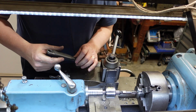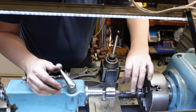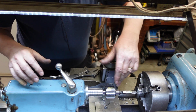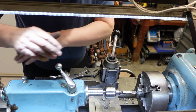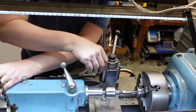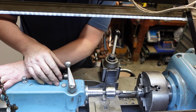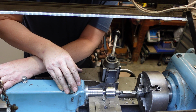When tapping in the lathe like this, if it's a small tap, I've got a couple of holders that work here, but for this one it's a little bit bigger. Fortunately, there's a centre pop in the back, so what I do is I put the centre in the tailstock and use that to apply pressure, and so you'll see me with my arms crossed over like that, and that's because I'm continually winding this while using just a wrench to tighten that up. Doesn't have to be an adjustable, it could be just an open-ended spanner, not a problem. And that's how I do this sort of tapping.